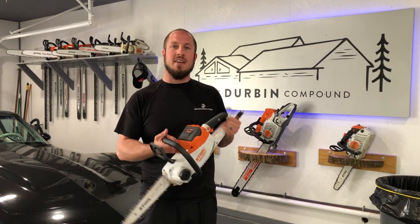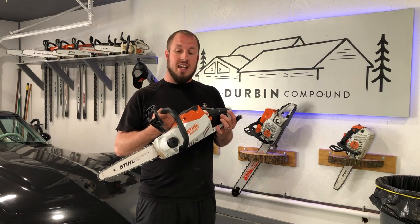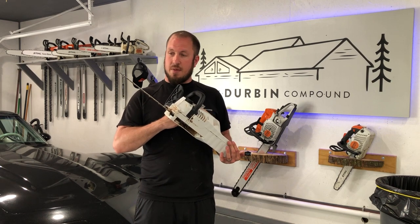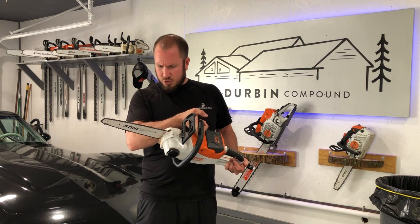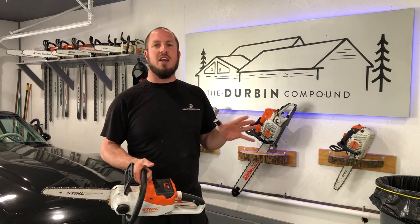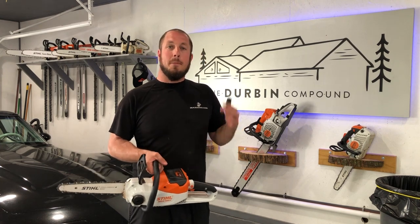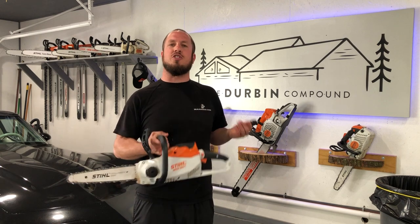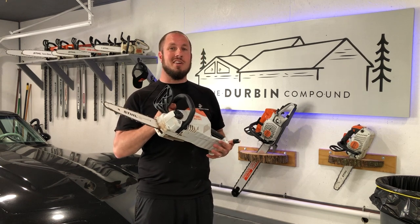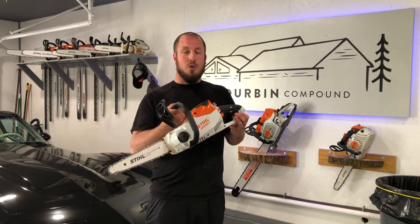This is obviously the cheaper end. I am going to probably purchase one of the highest end battery-powered saws that Stihl has and put it through its paces. This thing cuts phenomenally for what it is. I think this is a 12-inch bar on here — yes, 12-inch bar. This runs the quarter-inch Pico chain. I am definitely not a fan of the Micro Mini Pico chain — I think it's crap, it has a small chisel on it. But for a saw like this, that's what you need in order to drag some teeth through the wood. We're going to take this out and run it. I'm going to show you that this thing's pretty darn good for what it is, and those of you who are just looking for a battery-powered saw, this is probably right where you want to be.